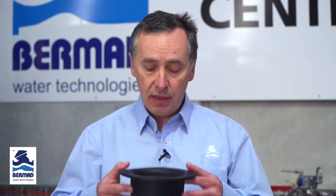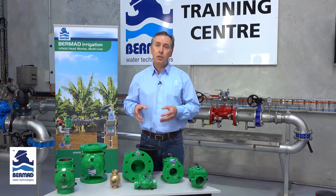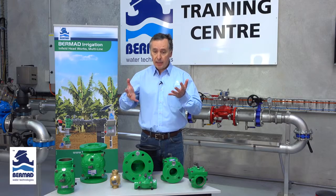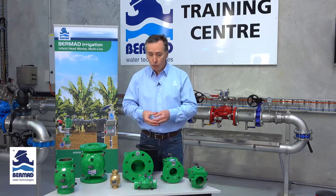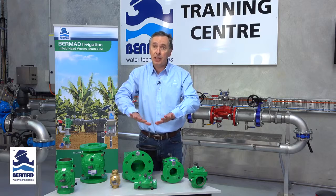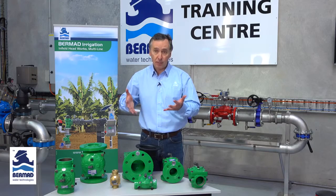A very important aspect of any control valve used in the field — being told to open and close to run water out to sprinklers or drip irrigation lines — is that at the end of an irrigation shift the valve must shut the water supply off drip tight. In many irrigation systems when the pumps turn off there's virtually no pressure in the valves. Typical weir-type diaphragm valves require pressure to keep the valve closed, so when the pump turns off you get leakage, partial pipeline drainage, and excessive wet spots in the paddock or orchard that can create mildew and other issues.